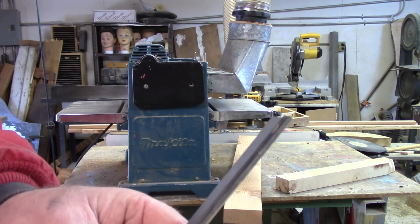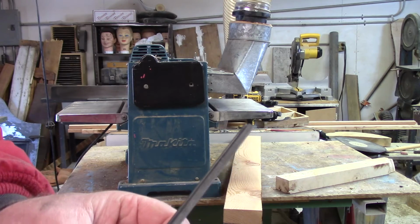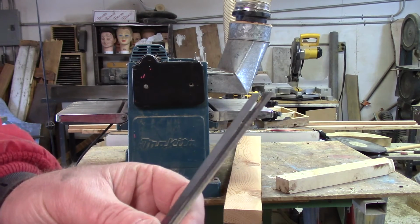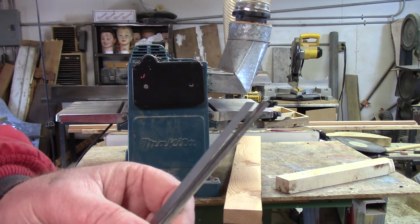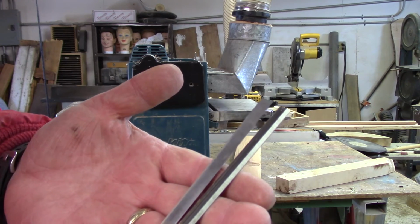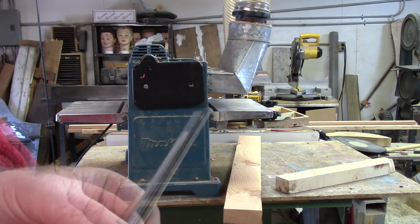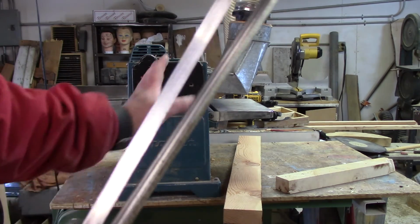With that burr, I was really prepared to see a much crappier run. I don't see that. I suspect it's probably due to the fact that they are wider, 0.2 millimeters, than the replacement Makita blades, and I think that's what's given it the cleaner cut. I suspect that the edge of my cutter bar was getting close, the chip breaker inside there. And that easily could be from me resharpening these. And certainly comparing these two to what I just put in the machine, that's not a fair trial of these. But in terms of, are these twice as good? I can tell you that right now, the answer is no.